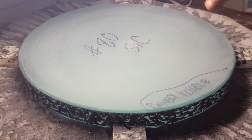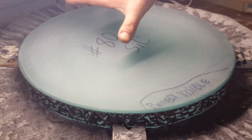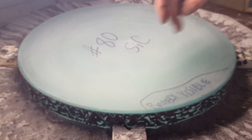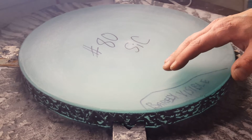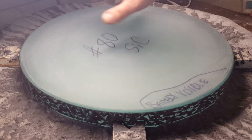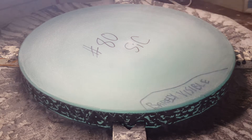This is a turntable here — it can turn at various speeds. I used a grinding method called fixed post grinding, or some people call it spin grinding. There's a post that comes down through here and it holds a grinding tool in place. As the turntable turns, the grinding tool is also round but a smaller diameter. The grinding table forces the tool assembly to turn around on top of the mirror as the turntable is turning, and the differential between the two is what causes the grinding.